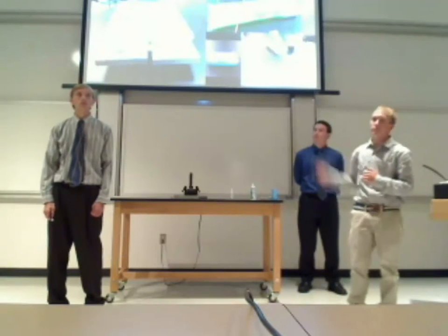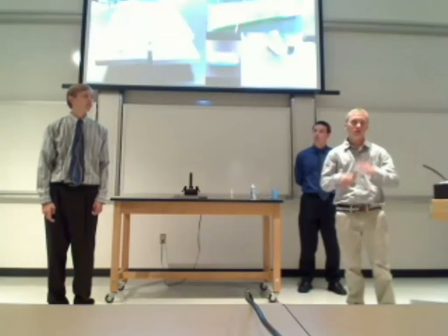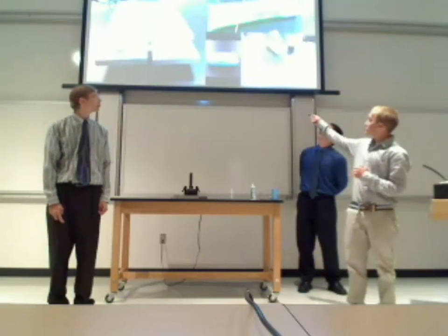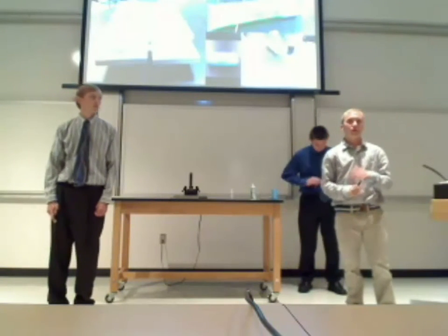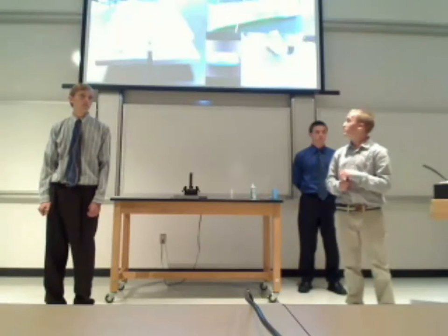Then we tried this electrogel from the biology department to lubricate the rails but maintain conductivity. It boiled when we ran a constant current through it, but with a pulse, it actually needs to be a small distance, like a few millimeters. Here's the capacitor we use. It's a 450-volt, 480 microfarad capacitor, and we charged it to 200 volts. And here are the zinc-plated steel BBs we use.